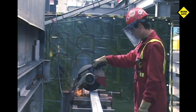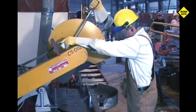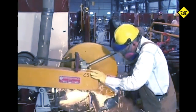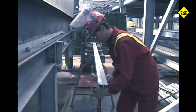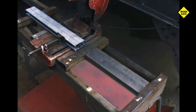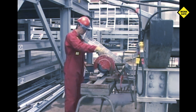If everything appears to be running well, commence cutting. Allow the wheel to do the cutting — excessive force will cause the wheel to glaze, reducing cutting efficiency, or bend and deflect the disc causing inaccurate cuts. Do not use too much pressure or you may cause the blade to fragment and dangerously fly apart. Do not use the side of the cutoff blade to grind, as side grinding will create grooves, reducing the wheel's thickness and compromising any fiberglass reinforcing the cutoff blade may have, which may cause it to shatter. Any lateral pressure on the blade may lead to deadly consequences. Long work pieces must be supported by a block so they will be level with the top of the base. It's a good practice to use a table that has an opening directly below the cutoff saw so sparks and hot fragments drop below the table and will not bounce back into your face. Finally, do not use a cutoff saw blade in a portable grinder.